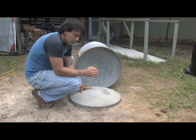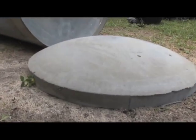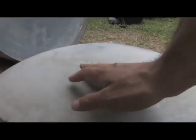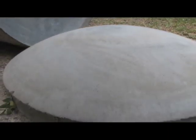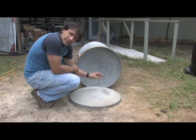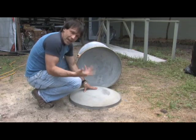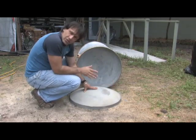If you live in areas with really low humidity, you want to wet this periodically throughout the day. You want to do this where it's not out in the sun because the sun will crack this — it'll dry it out too fast. Never put a fan on it or try to hyper-dry it that way; all it does is make it real brittle. By adding water to this, it makes the concrete stronger. So over the next day, we're going to just wet this with the hose and let it sit.